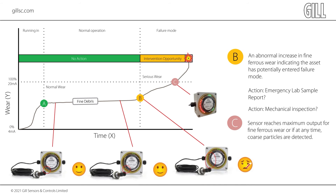Maybe there is water ingress, maybe it's a lack of lubrication, maybe it's something else. What this does mean is a call to action for maintenance personnel to inspect the gearbox. If caught early enough, a scheduled maintenance action can be taken and unexpected downtime can be avoided. If point B is missed, the sensor will continue to attract debris until its maximum limit — this is point C on the graph. If using the LED display, red flashing lights will indicate this.